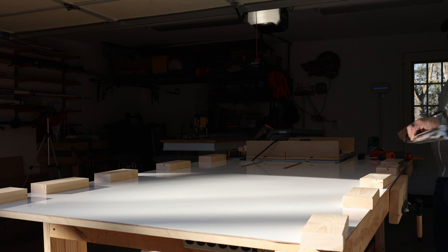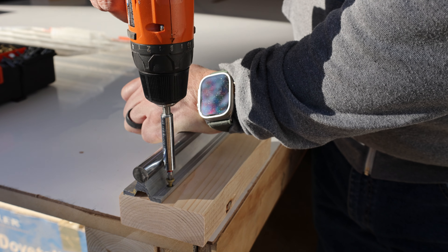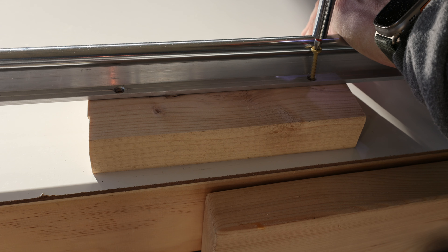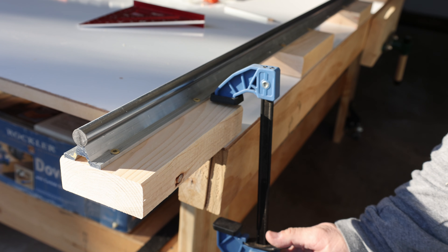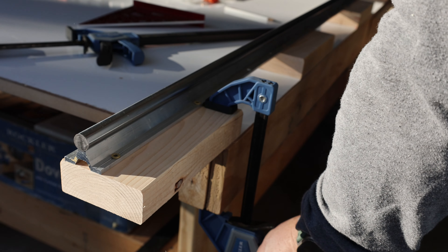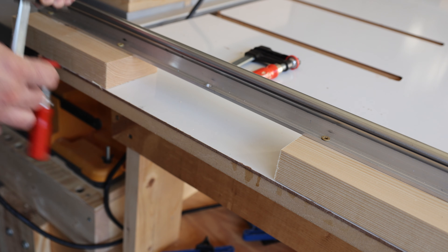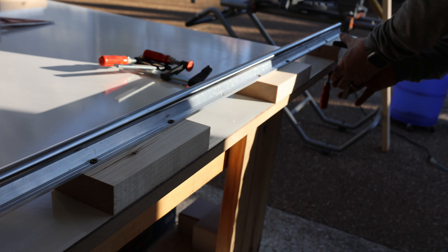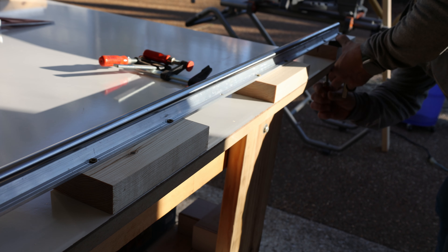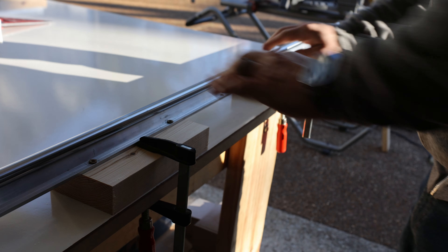Now we're going to take those last two pieces of acrylic that were cut off at the beginning and use them to keep the rails at a consistent width apart from each other. The router sits on the base, the base sits on the brackets, and those brackets run on the rails. What I don't want is for the rails to start binding by getting too close or too far apart. So we took these pieces of acrylic and attached them to the rails to keep them consistent from one side all the way to the other. And yes — it is still satisfying pulling this film off. All of the holes line up perfectly, two on each side, cut to line up with the existing holes. Once attached, you just give it a little bump and everything screws together perfectly.